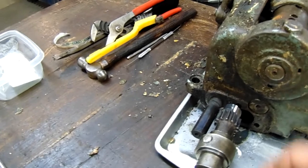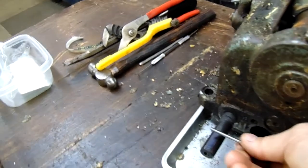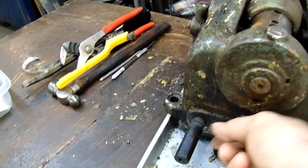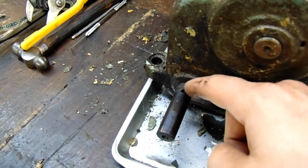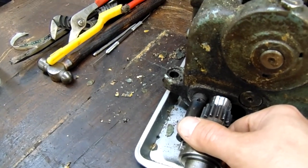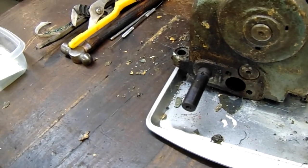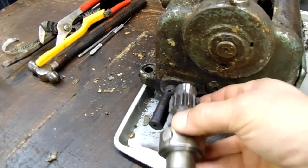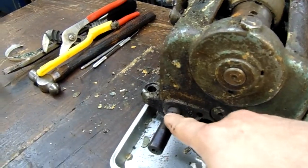Instead of stopping and figuring out what they were doing wrong, they just kept hammering on it and really sunk this pin in. This taper pin has nowhere to go when you're beating on it but deeper and deeper, which also, because of the way the shaft is, will expand the shaft a little bit. And that's what it did — it bugged the shaft out inside this sleeve, which made it very difficult to get off. I heated the outside trying to expand the sleeve, but it just wasn't happening. I couldn't get the pin out at all.